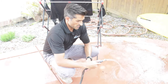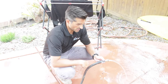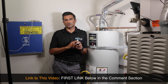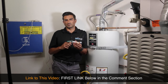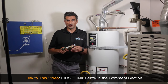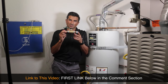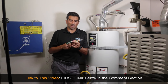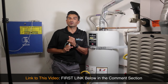Regardless of what water heater you have, that method is going to guarantee you some flow. And if it doesn't, open up the valve and jam a screwdriver down there - you can get anything out if it stops. Bigger hole, your tank's going to drain. The stock drain valve on water heaters is pretty much useless, especially after the first couple of years or if you have hard water minerals in your tank, which is almost everybody. If you're interested in how to build this valve, jump over to quickwaterheater.com, click on the FAQ section, and look up 'water heater drain valve.'